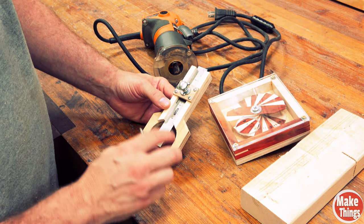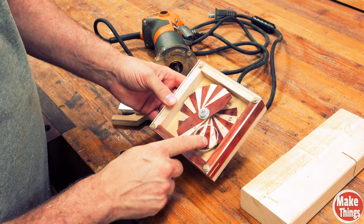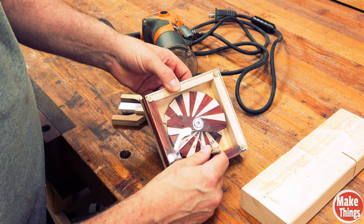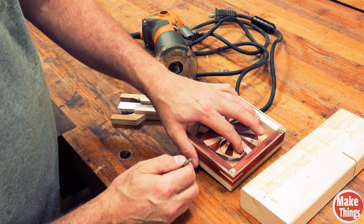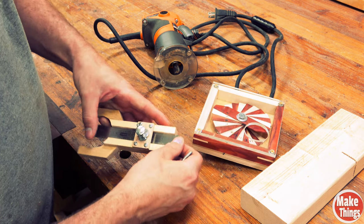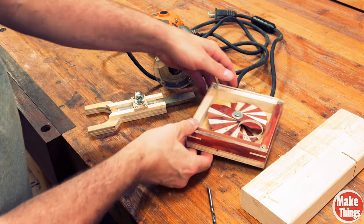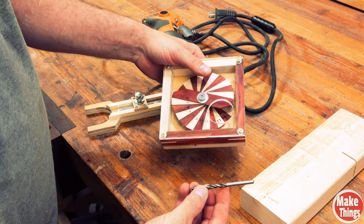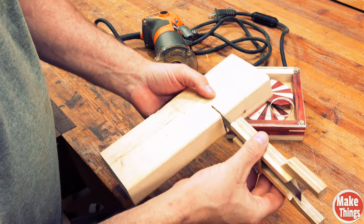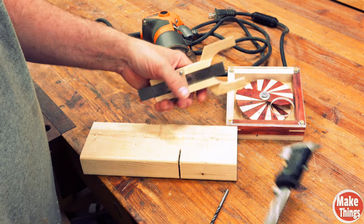Now that I've built this, I'd like to show why I like this much better than my spiral jig. While the spiral works really well for setting dado blades as well as drill bits — you can add a piece of tape to each depth — what I don't like about it is that it's very limited, up to about seven-eighths of an inch. With the simple gauge I have a much greater range. And while the spiral only does dados and drill bits, I can also check depths with the simple gauge — for instance, checking exactly how high a table saw blade is cut.